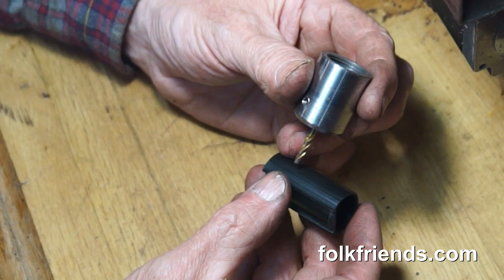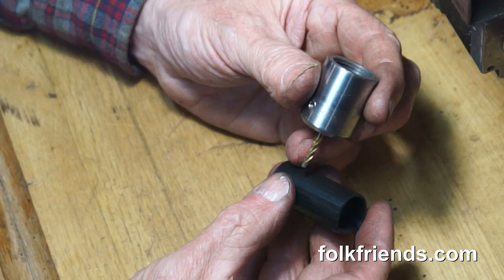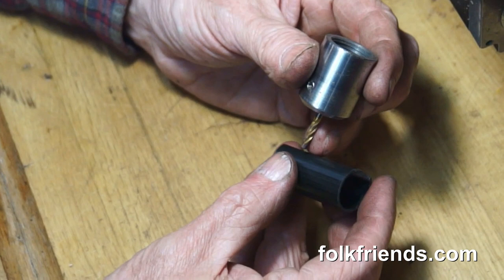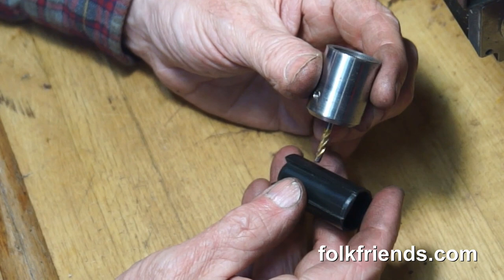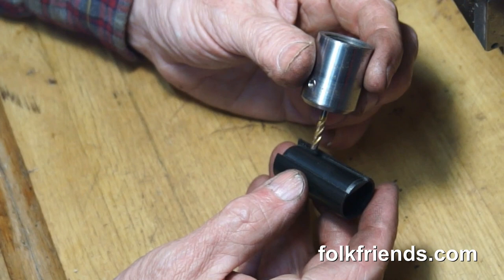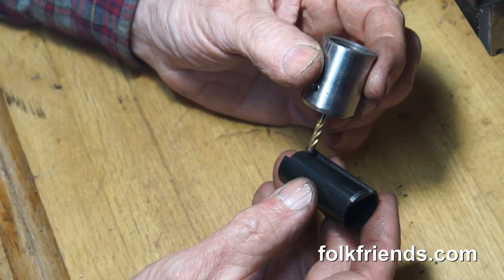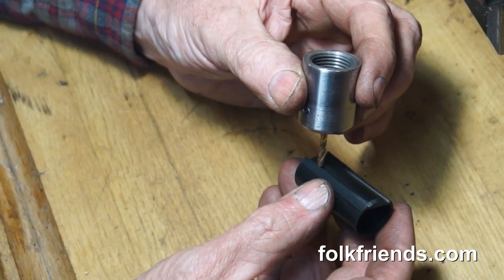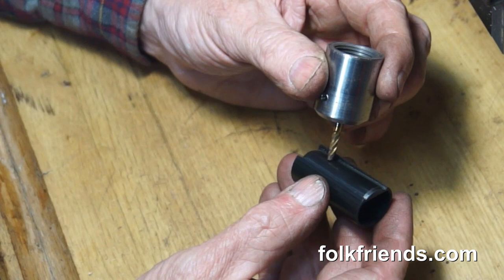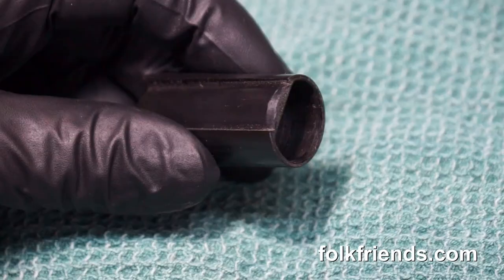I'm going to show you the cuts that the machine makes. If you notice, this block is not a circular, round, smooth cylinder — instead it's faceted; it has a bunch of flats on the outside. The reason for that is that I put the material in the machine and have it cut the block to a known size and position. When it's of that size, it's a precise size to fit inside the head, but it's also a precise position that the machine understands. Knowing that position, the machine cuts the windway, this notch, this groove, this recess in it, to a precise relation to the outside of the block. If I had cut it round on another machine and then put it in, there would be a loss of precision — a loss of agreement about where the center was or how deep anything was.